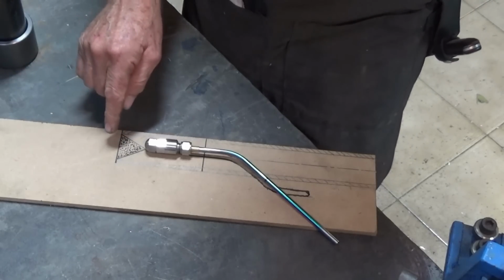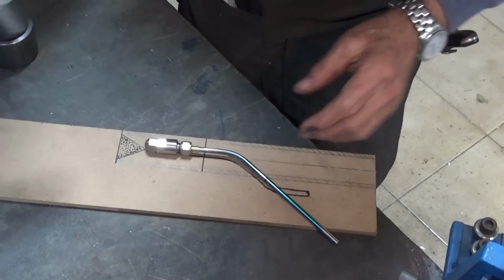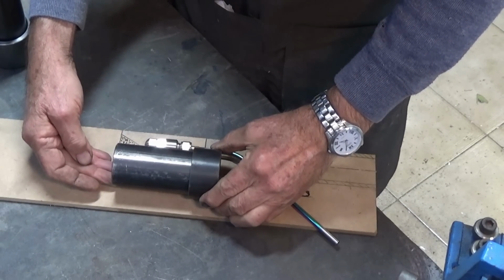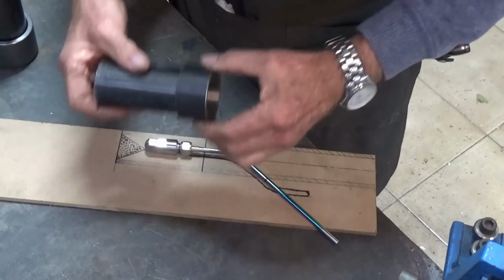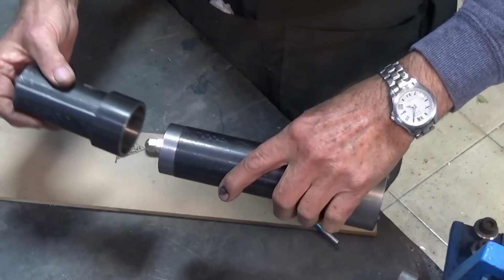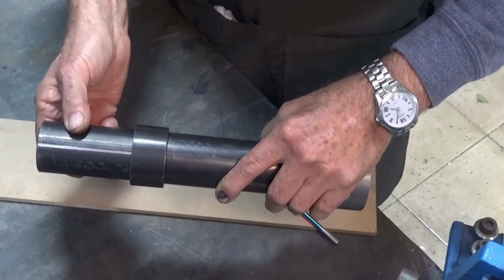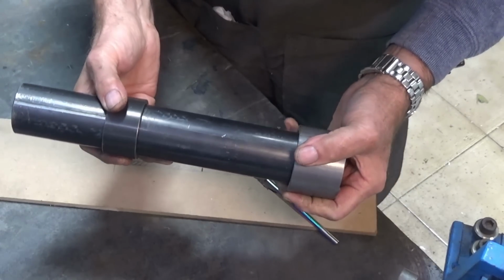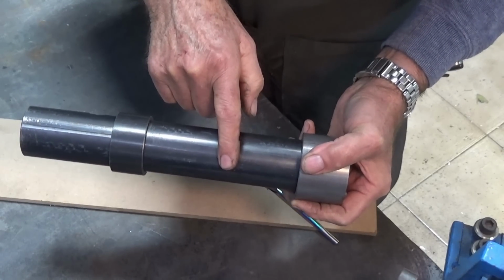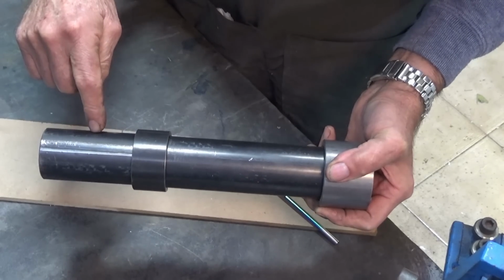What you're looking at here is a 2D mock-up of my burner assembly. And this front half is going to be more or less mounted in the furnace permanently. And this back section here is going to be removable. And the two halves fit together like that with that coupling in the center. So what I need to do is to arrange the fuel delivery line to enter through the side of this section here and extend forward into the permanently mounted section of the tube.